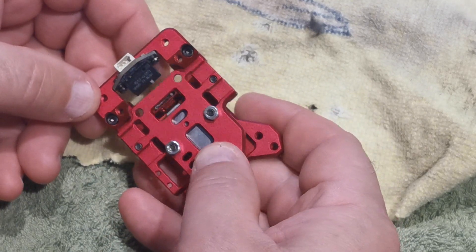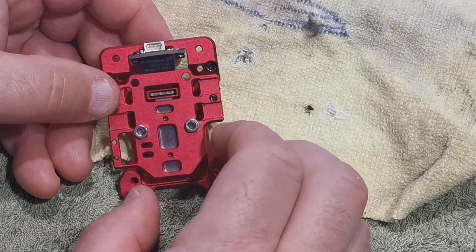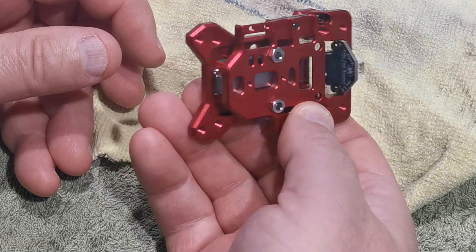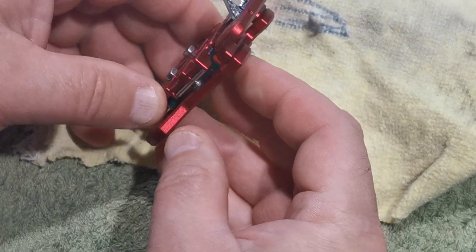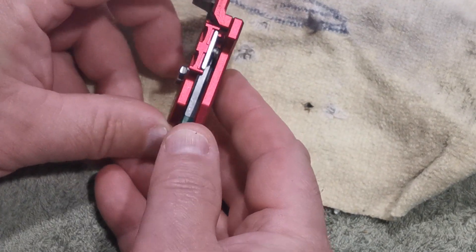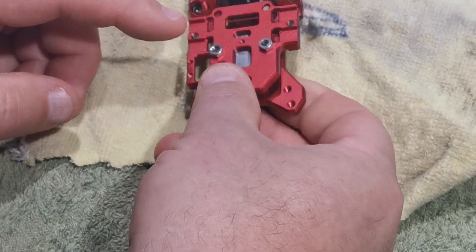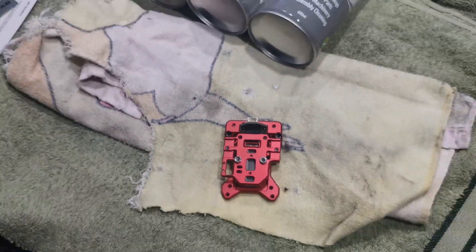What the manual tells you is that there's a linear rail which you can barely see - you can see part of it there and another part here. There's a shiny piece running down through the center - that's the rail that the tap slides up and down on. The first thing we've got to do is clean that rail of the preserving oil and then re-lubricate it.